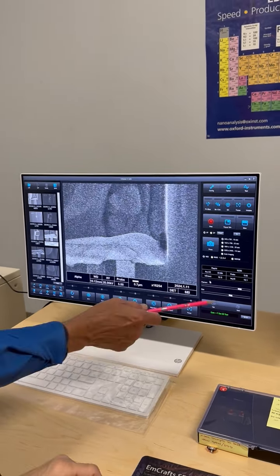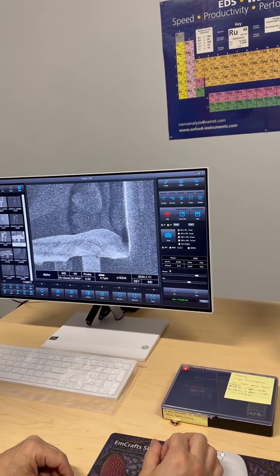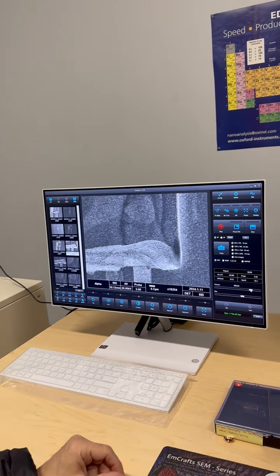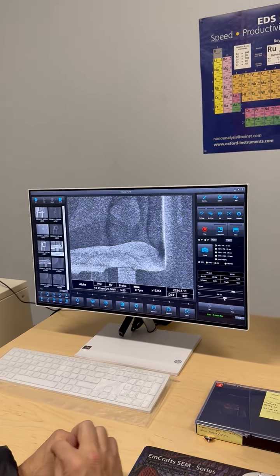We see around 700 or above with a brand new filament. By the time the filament wears out, this number will be reduced. This voltage is the same — that doesn't change. If the filament's wearing out, that's irrelevant. If the filament is wearing out, you could add more current, but you can't change the voltage.